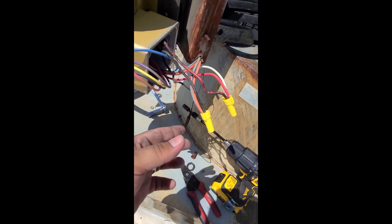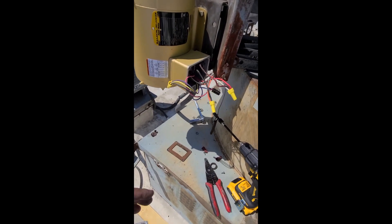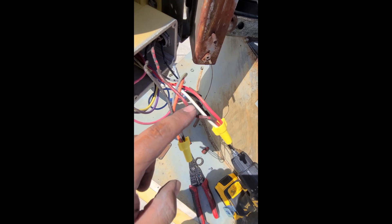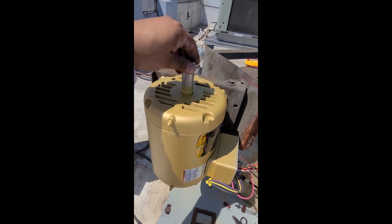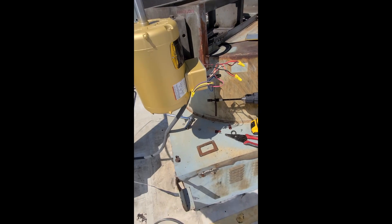Here's the black wire — I'll grab any two motor wires and put them to the black wire. Then the last set of two wires goes to the remaining phase. You can see the old wire going to two fresh wires, the old red wire going to two fresh wires, and the old blue wire going to the pink and blue. All three phases are hooked up. We want the shaft turning the correct way. Before solidifying anything I'll tighten this nut just hand-tight since the motor is about to start.